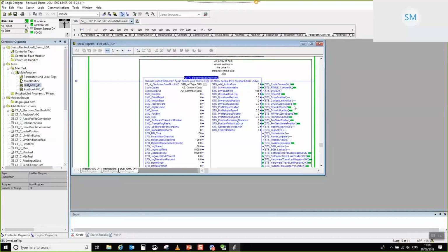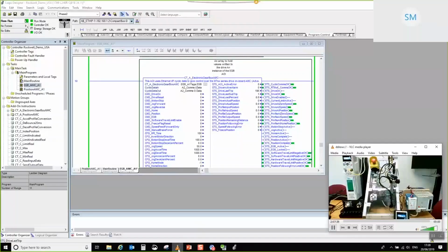Okay, so next thing, as I said before, let me just turn back on the video feed so you can see what I'm doing. There we go. I'm going to release this e-stop button, which happens to be controlling the enable. It's not a power off type e-stop in this case, it's just simply controlling the STO. And as you can see here, the drive enabled, if I turn that off and on, it's being controlled. The video feed's a little bit behind, a couple of seconds or so, but you can see me doing that, which is good.